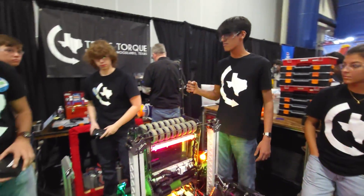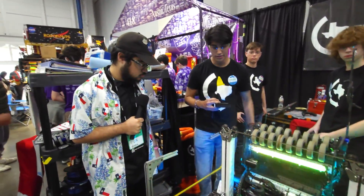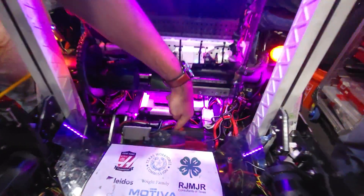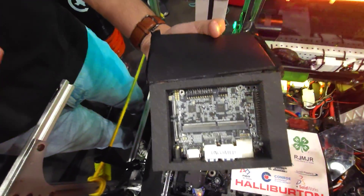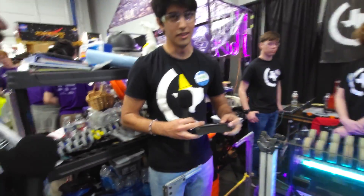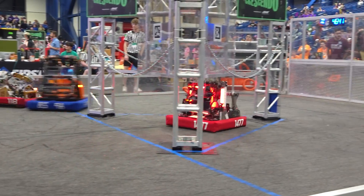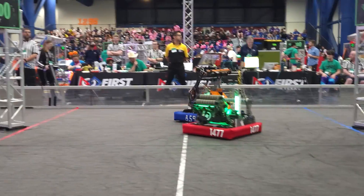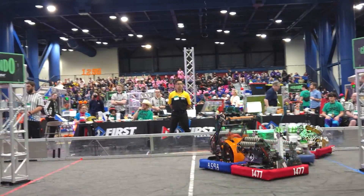I want to hand it off to Omar. Talking about the vision system you guys have — it seems like you have some special cameras. So this year we're running a custom vision solution that is running a Python script that handles the AprilTags. That is running right here in the center of our robot under our rotary motor — this NVIDIA Jetson Orin NX. This runs a big GPU that lets us do some cool note detection. We knew going into this season that vision was going to be a big part of this game, and it would allow us to compete with some of the top California teams. We spent a lot of time in the offseason in R&D on different co-processors and programs to see what would work best, giving us the most flexible solution to put cameras all over our robot and get a really accurate pose from the April tags.